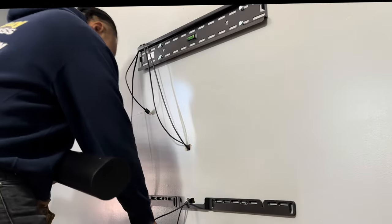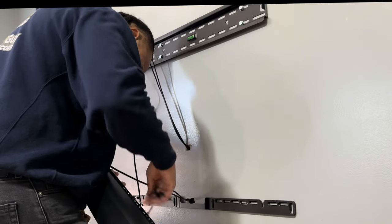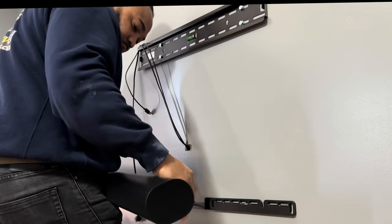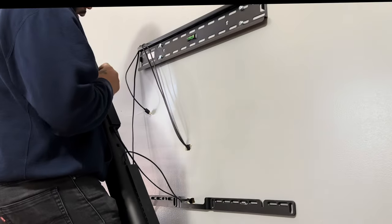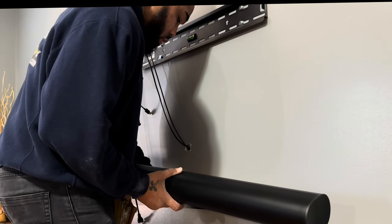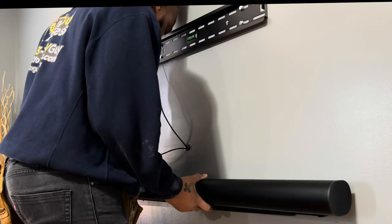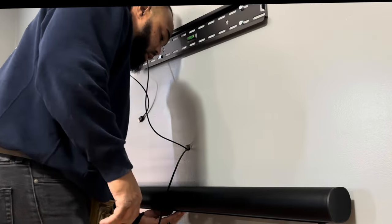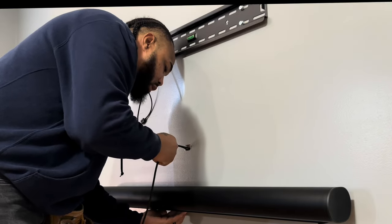So I'm going to plug this stuff up real quick. The soundbar has these two little screws that you put in the back of it — these screws allow the hook here and hook there. Sometimes you have to adjust it to make it tighter to the wall — you keep screwing them in and get it tighter and tighter to the wall. So it just hooks right on. Then you pull the wires through — you don't want to pull too tight, you just don't want them dangling at the bottom. Pull through enough that you don't have wires dangling, because you want it to look wireless.